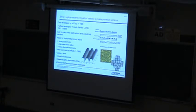And so you can see we were able to make the little lenslets. Our first prototypes were done with a binary process. We used multiple masks to slowly build up the structure from different levels of etching. And the neat thing about micro-optics is you don't have to make regular structures. You can add tilt to each of the lenslets. And so each one of these lenslets has a different center so that the lenslets approximate an area around shape, but the spot pattern they create is a square grid. So it's kind of typical: pupils are round and typical detectors are square. So that was our thought here.